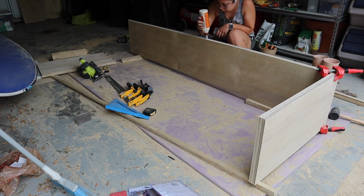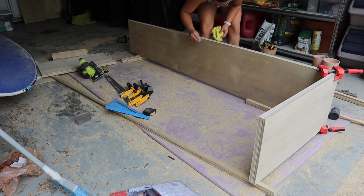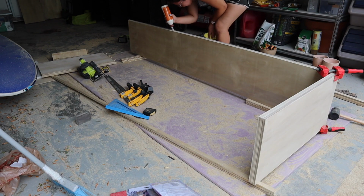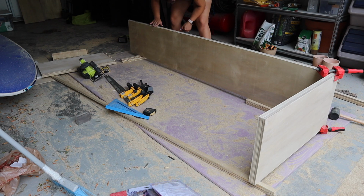Shortcut number 5, not mixing the glue and sawdust together into a paste before using it as wood filler. This is what I normally do and it works and stains really well. This time I just put glue into the needed areas and put sawdust on top. Not the same result, and those spots stood out in the end. Hindsight, am I right?